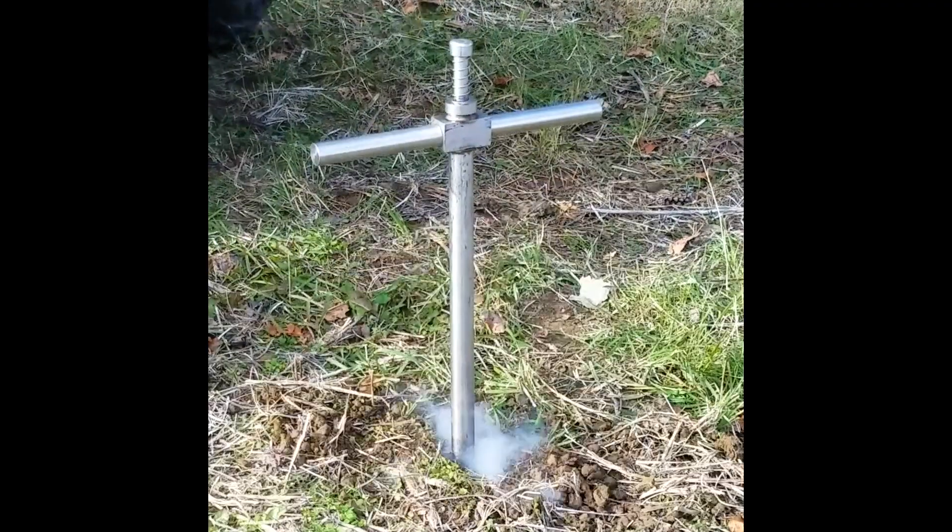What we're doing is drilling holes for what's called a buffalo seismic source. It is basically a tee that screws into the ground with a firing pin that runs down through it to an 8-gauge shotgun shell that is packed with an ounce of black powder, and detonates at three feet below ground to make an awesome seismic source.